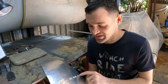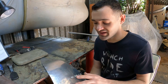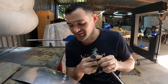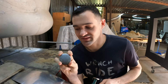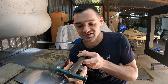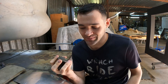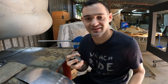Now we're going to go ahead and planish these tacks to get everything nice and smooth, and once we've planished it we'll grind down the tacks to get an even weld. This is the hammer and dolly I'm going to use to planish the tacks for this panel. When I'm holding the dolly I'm just using a couple of fingers — two to make sure I'm holding the dolly level and the opposite two to make sure I'm running along the weld bead, so I can be sure my dolly is exactly where I need it.